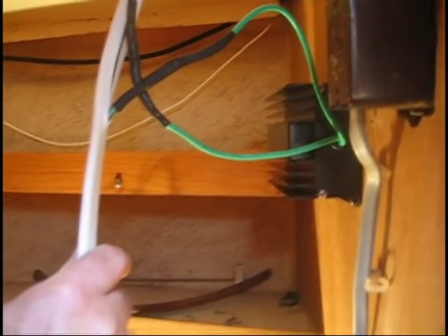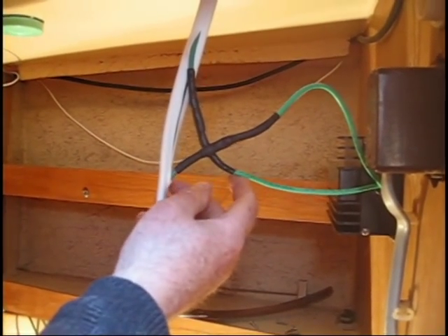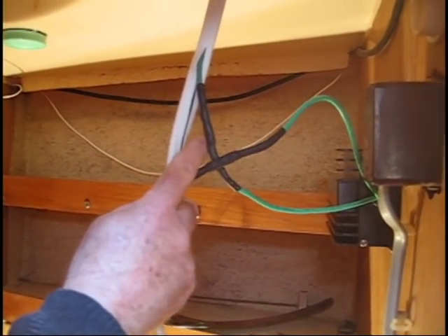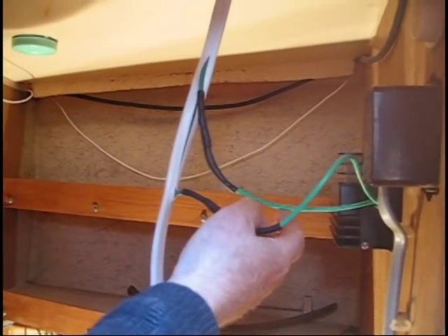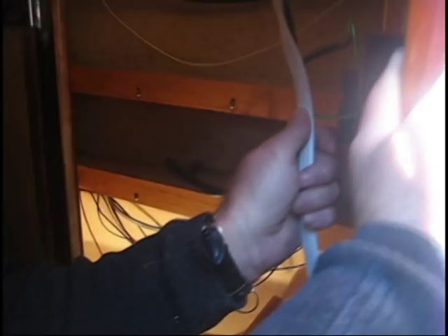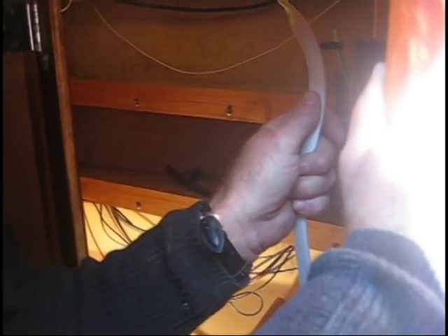As you can see, the new cable has been cut and the green wire exposed. We've merely cut the green wire coming in from the shore power plug and wired it to the galvanic isolator. Now that we've completed this, we will secure this wire at a number of places to prevent movement and fray while the ship is underway.